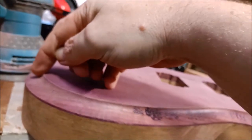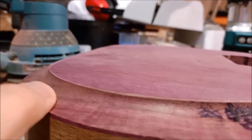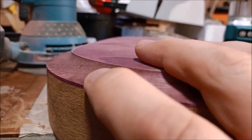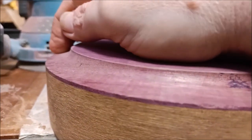I've begun using this sander but I'll do it by hand as well, sanding off that ridge to soften that transition — that'll be no trouble. One of the things I like about the shape of this, and one of the reasons why I wasn't happy just using a cove bit, is that the bottom of the profile is almost flat. And that's quite useful here because I think I'm likely to put a single layer of cream binding around this top, and having a somewhat flat surface there for the scraping will make life much easier.